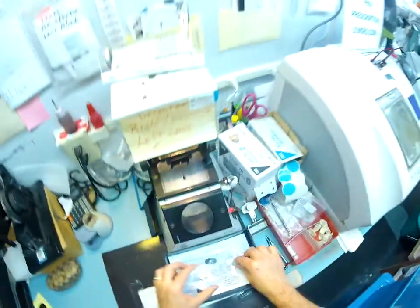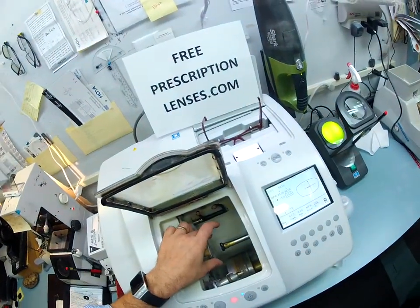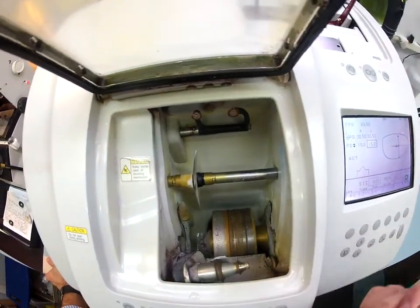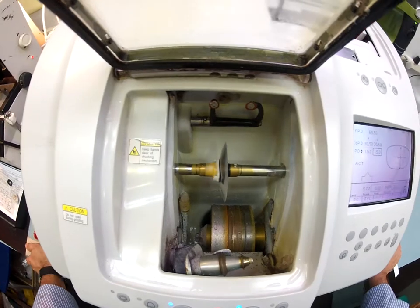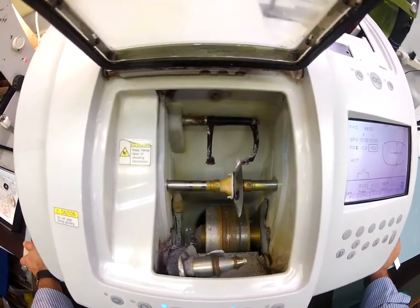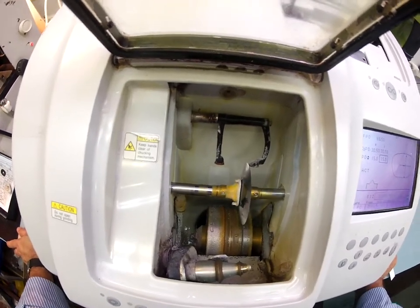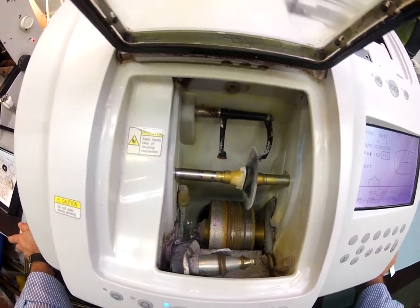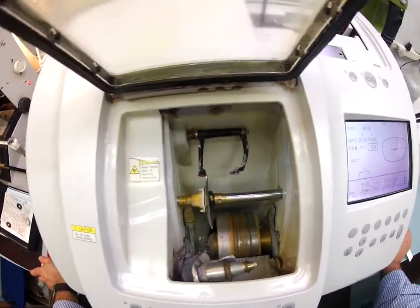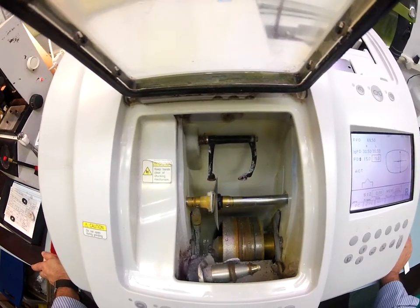I'm going to put your right lens into the chuck and hit start. The first thing that happens: calipers come down and trace the shape of your frame onto the prescription lens to make sure it is large enough to cut out. It is tracing the concave side of the lens first — closest to your eyelashes — then it will scoot over and trace the convex side, which sits away from the face. The calipers are measuring the thickness of the lens where it is tracing, to know exactly where to put the bevel so it stays inside the frame.